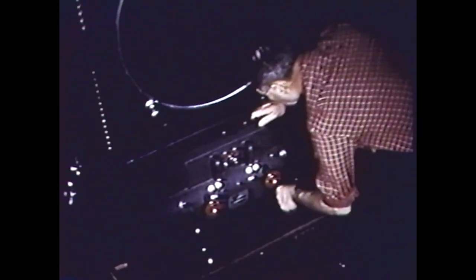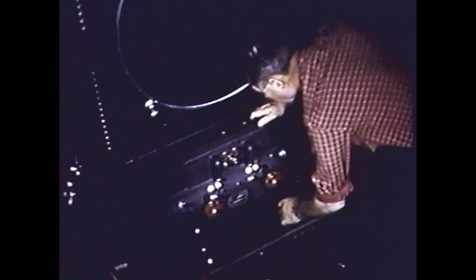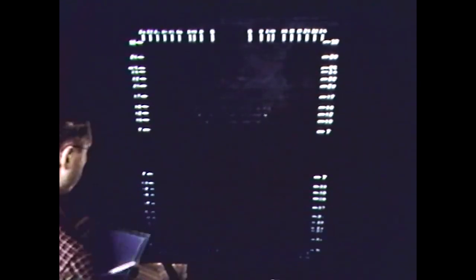This is the back of the camera. It has been built into a dark room. This very practical arrangement permits the film to be handled, inserted into the camera, and finally developed without leaving the dark room. Before the picture can be taken, this camera, as with any other camera, must be focused. The film is placed on the film board in back of the camera. Then, through tiny holes, a vacuum sucks the film tight and flat against the door. When the door is shut, we are ready to make the exposure.